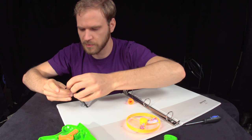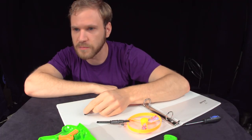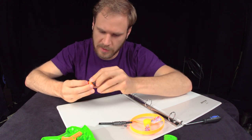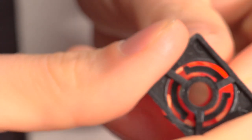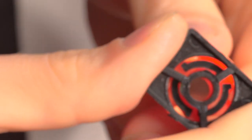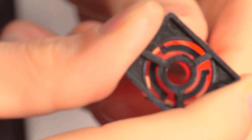So it's got this square piece, and it's square just so it could fit into this little holder here without turning — that's why the outside is square. And then it's got this circular hole in the middle so that this rod can fit through it. And then it's got these three arms. Because the plastic is flexible, they're kind of springy. So this is how the ratchet mechanism works: you turn one way, it's stuck. Turn it the other way, the teeth push the three arms of the black piece in, and then when they turn enough, they snap back out. And you can't turn it the other way.